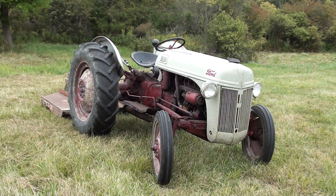Total weight of the tractor, not including fluids, is 2,410 pounds. Gear ratios at 1,500 RPM: first gear, referred to as low, is 2.77; second gear, referred to as plowing gear, is 3.56; third gear, referred to as cultivating gear, is 4.90; fourth gear, referred to as high, is 10.23; reverse gear is 4.55. The fuel tank is located just ahead of the steering wheel.